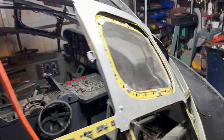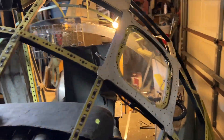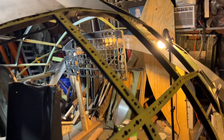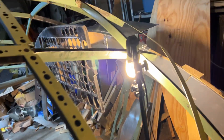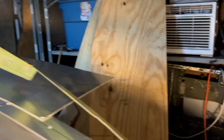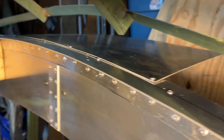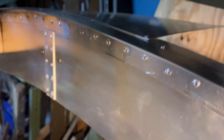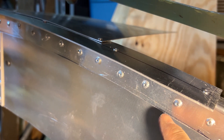Let's go over here and have a look at the other side. One of the reasons I build so fast is I don't measure rivets. On external surfaces, for beautification purposes, they're every one inch, but when you get into surfaces that you won't see like this bulkhead, I just take the drill and kind of have at it, close to every one inch. Convair used a lot more rivets — exactly one inch apart, and every half inch there was one down here.